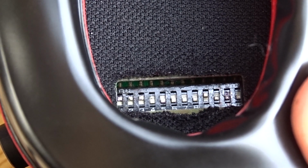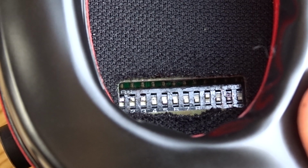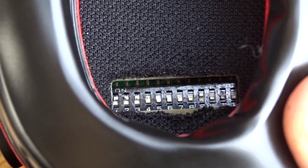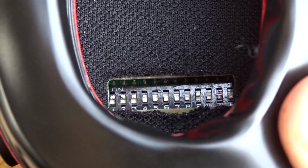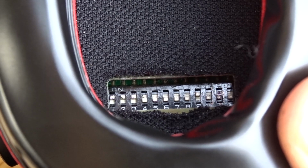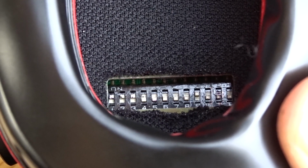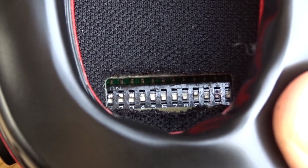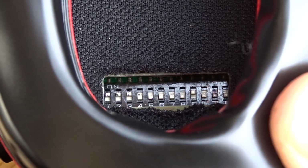Dip switch 3 is a tandem intercom, effectively your side tone. Dip switch 4 is mic sensitivity, and I've left that down because I found the microphone loud enough as it is. Dip switches 5 and 6, I was chatting with MicroAvionics about this. They've started turning those on because it reduces the transmit level, basically to stop the microphone and the output getting oversaturated. I've found with communications I've had with all airband units and other aircraft that my transmission level is fine, so I'm leaving them down.